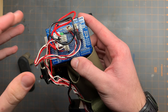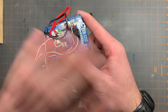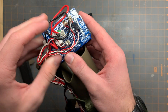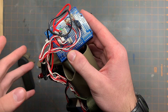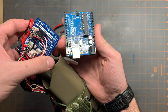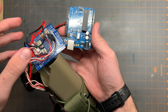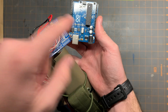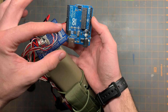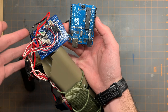Okay, so this is the electronics. I salvaged some quick connectors from a different thing that I found. And then here's the MOSFET, which controls the whole thing. Here's the old relay that I don't use anymore — it's just still on the board because it's too hard to get off. And this all sits on a daughter board on top of an Arduino Uno. If you had an Arduino Nano with the code I'm using, it can run the same code, so it'll be way smaller. In future builds I'll probably do that. So this runs off a MOSFET using the simple code.